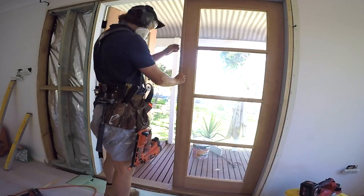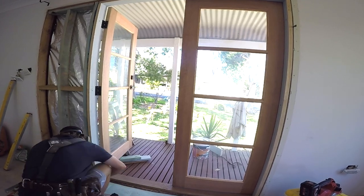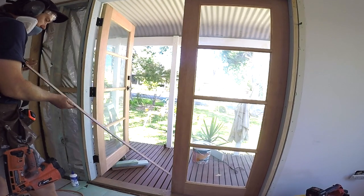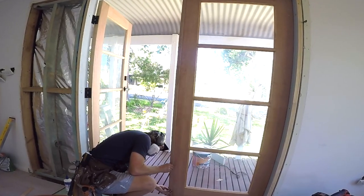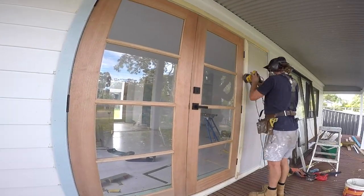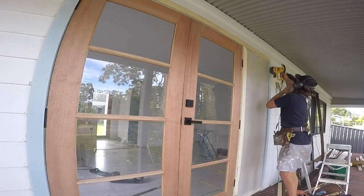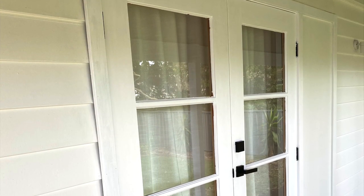It's common for French doors to be rebated at the centre which closes the gap between the two doors. As these French doors are not rebated, I will attach a small piece of timber trim on the inside of the first left hand side door that does not have the handle attached. To finish off, I've reused some of the original architraves and hardie flex cladding. The only thing left to do now is to finish painting the doors, cladding and architraves. Once that's finished, the project is complete. I hope this information was helpful and thanks for watching.